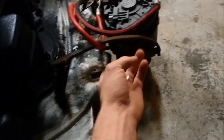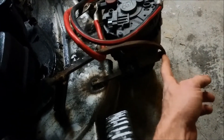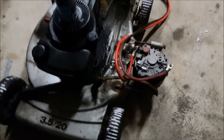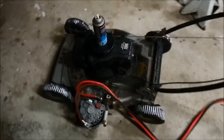I just have a little crossmember going across there. This was how I was adjusting it — I ended up just welding it, but it used to be adjustable. Now it's just fixed. The belt is fairly tight, about right. Once this belt gets older and stretches, I'll have to replace it more often because I don't have it spring-loaded or adjustable. That's one downfall of doing it the way I have done it.